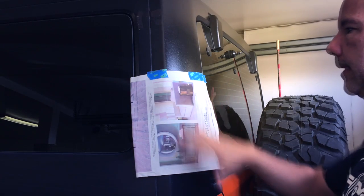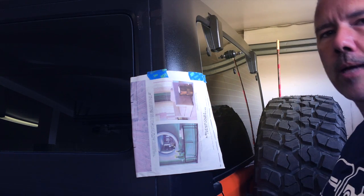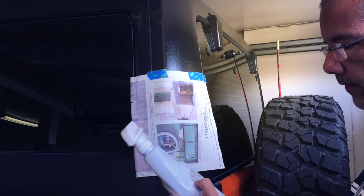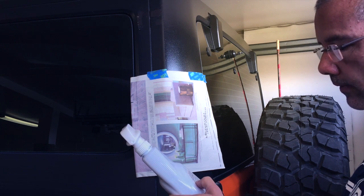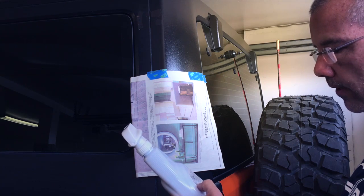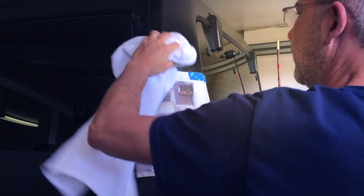I've masked off a section here — we're going to spray the Aerospace 303 above it. Everything below that will be raw, unprotected fiberglass and plastic. The instructions say to apply out of direct sun, which we're not in. Spray the surface with 303 Aerospace Protectant and wipe completely dry. If streaking occurs, too much product has been used — immediately wipe dry. This product does not air dry. Extra buffing increases bonding. That's probably too much, so we're going to have to do a lot of buffing.